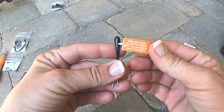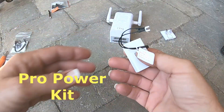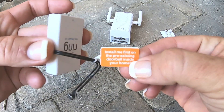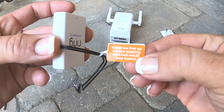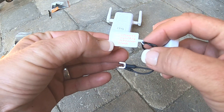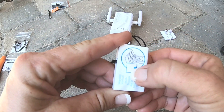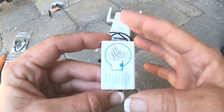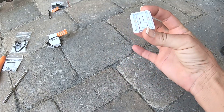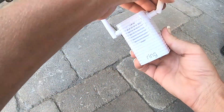You're probably wondering what a pro power kit is. This is a pro power kit — it's a device that ensures enough power is sent to your Ring doorbell for it to function properly. The label says 'install me first on your pre-existing doorbell inside your home.' It has a small piece of adhesive so you can stick it on the inside of your doorbell so it doesn't move around or muffle the sound. The last item is an attachment for your Chime Pro — just slide it in the back until it snaps into place so you can plug it into the wall.